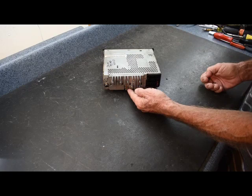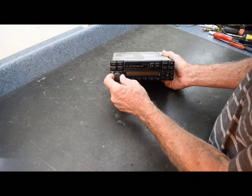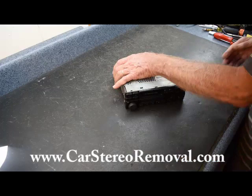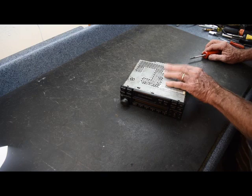To repair this radio, I have another video on the website that deals with cleaning the volume control by removing the knob and spraying it. I'm going to show you how to repair the button problem and the backlight problem. You could also have a phone mute problem — in that case, look to the trunk. Many of these vehicles are pre-wired for the phone, and I've seen the wiring get into the wheel well and short out with moisture. You might want to clean that connector and check for a short there.